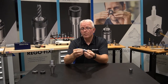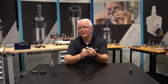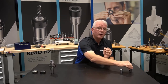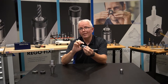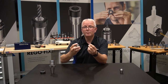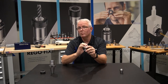The problem was brought to RegoFix and Fritz Weber, asking him to fix and solve it. And that's what they did. They took the E collet and created the ER collet. They added the extraction groove on the outside of the collet itself, and they created a special nut with a lip on the inside, made to extract the collet during the nut removal process.